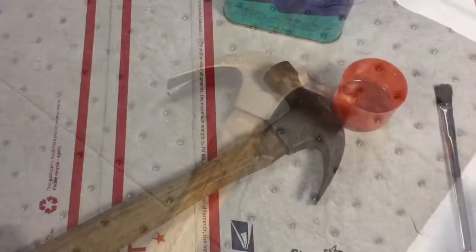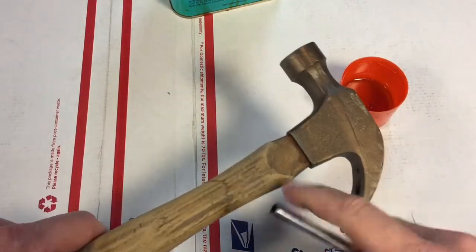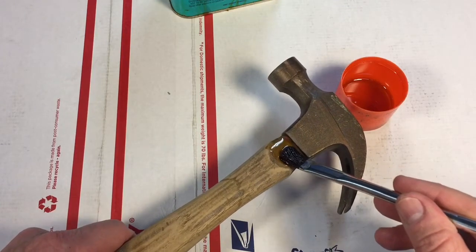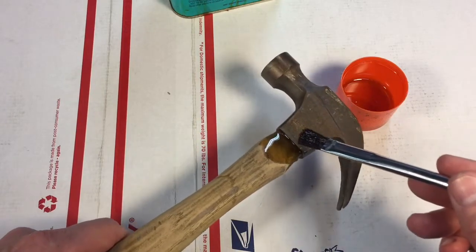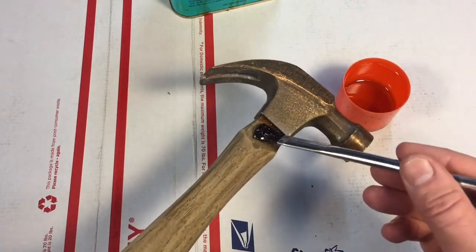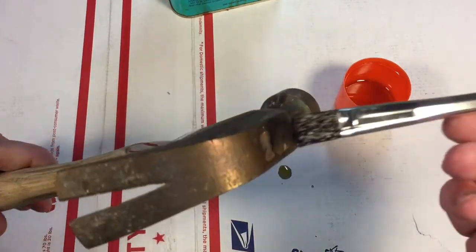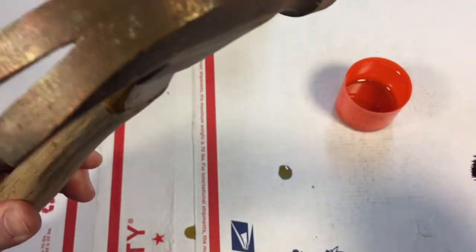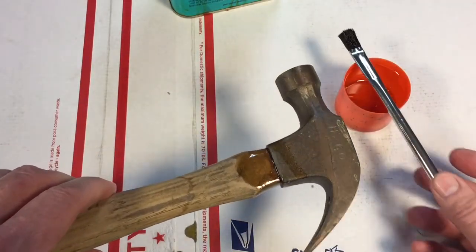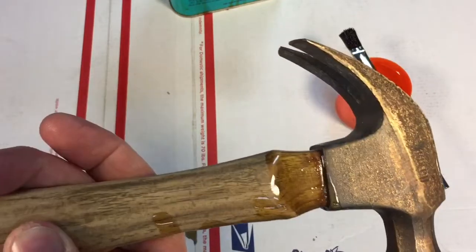So we're going to figure out what kind of finish we want to put on this handle. Using boiled linseed oil — we put a little bit in a cup here and we're using an acid brush. We want to get just the end grain. We're going to dip it in and be very generous because you're going to see how it soaks in there. We're going to spin it around and apply it to all the exposed end grain, let it soak in underneath. We'll also get the top over here, but when we do the top we're going to stand the hammer up so it absorbs that way. In about 10 minutes you're going to see the absorption of the linseed oil into that end grain — it's going to suck it in really quick. Keep doing this until the suction stops.